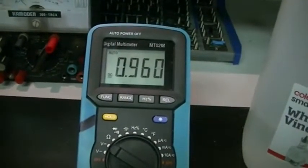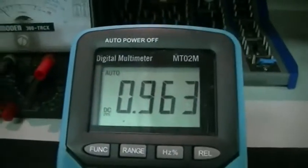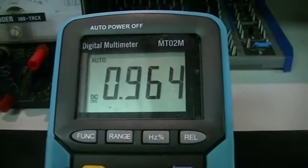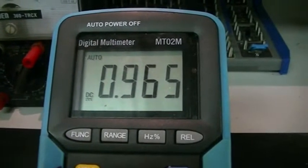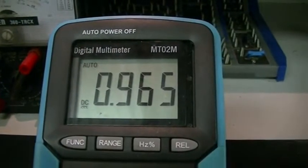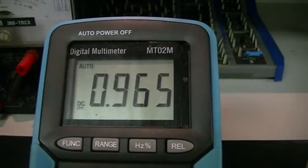We'll put him in there. I've made out a striped wire here — negative — which will be the negative down the road. And the other one of course is positive. That is our cell across a 100 ohm load after just four cycles. As you'll see, it takes about — by the time you've done your two-minute input charge, dried it, let it sit for a minute — so four or five minutes between cycles. That's only been cycled four times, or conditioned four times.